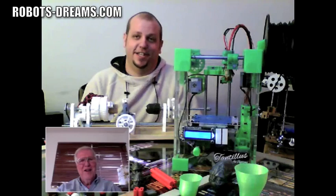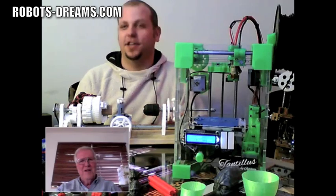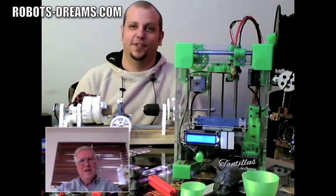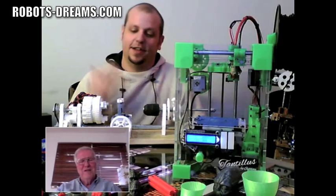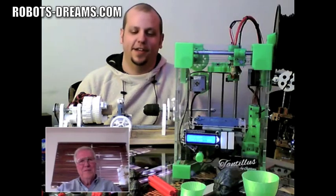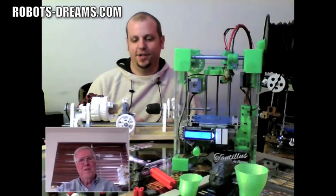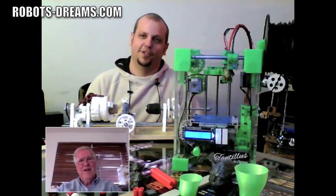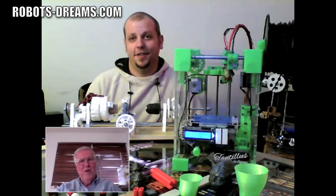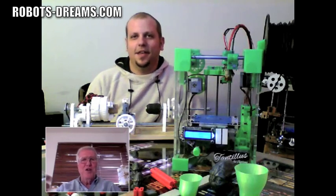It's plastic, so it has the limited lifespan of most plastic things. I prefer to print PLA, and it is actually compostable in 50°C compost bins — a well-maintained standard house compost bin will break it down in a short period of time. It can also be recycled way more than ABS. ABS off-gasses about 5% of its volume, which really changes the properties as you extrude it. PLA is only about 1%, so it can be reused a lot more. And you can make your own replacement parts — you know what's going to wear, so you can print two or three of the same parts.